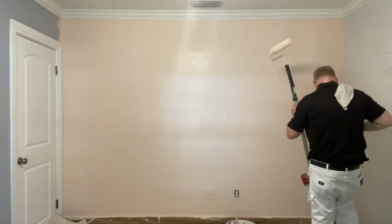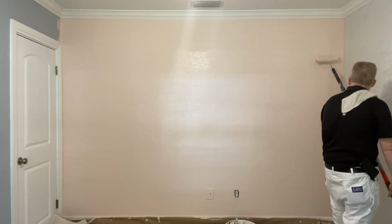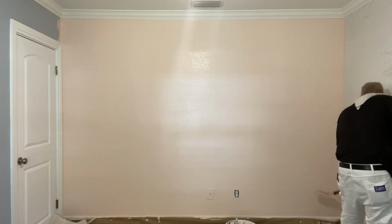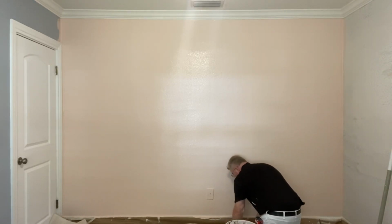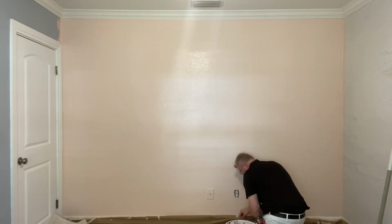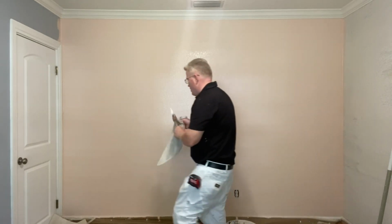That edge that has the metallic arm or the elbow, that's going to get more pressure on that side. So you want to be aware of that while you're painting. And you want to adjust your wrist so as to equally distribute the pressure that's on that roller so that one side with the arm doesn't take a disproportionate amount of pressure, causing what's called edging, where you create a visible, ugly edge because of the disproportionate pressure that you're pushing onto the roller.